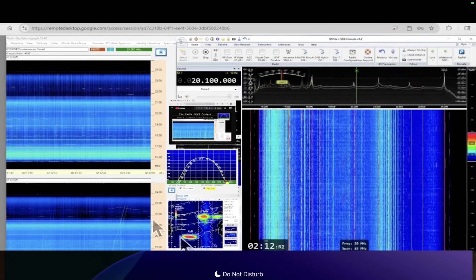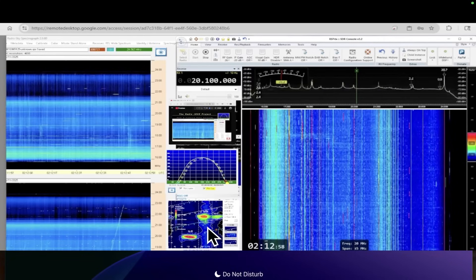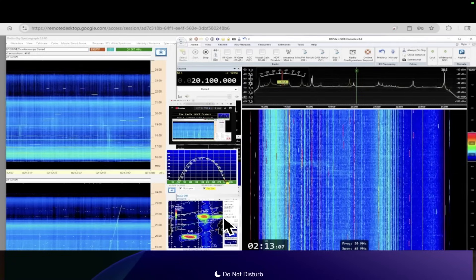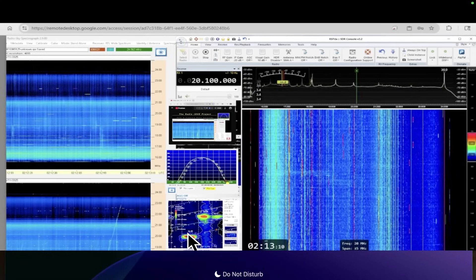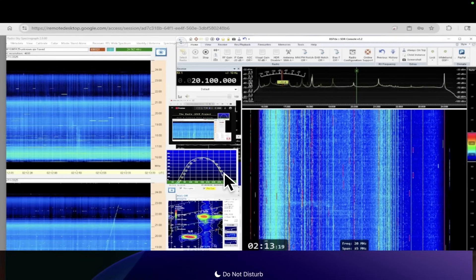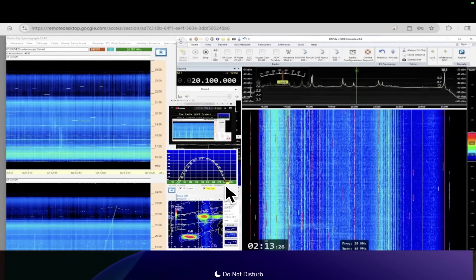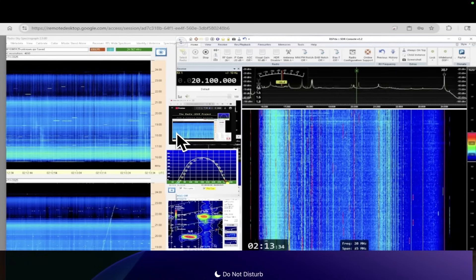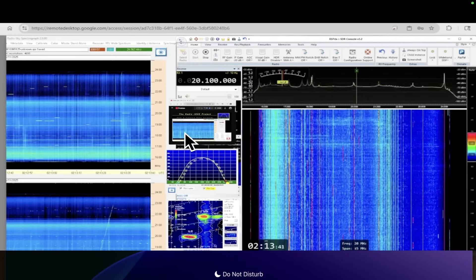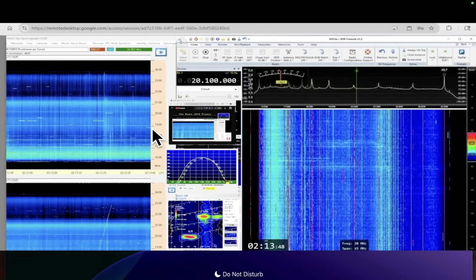In the middle, we've got three different frames. The bottom frame shows the position of Jupiter's moon Io compared to the line between Jupiter and Earth. Radio bursts from Jupiter occur during particular positions of Io in relationship to Earth, and they are marked here. The middle frame shows the altitude of both the Sun and Jupiter — as you can see, both are below the horizon. And finally, this is the official live stream of Radio Jove. So if we see an event here, we can compare it to the official live stream to see if they captured it as well — that's a great way to determine whether we're seeing a real event or an artifact.